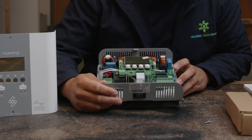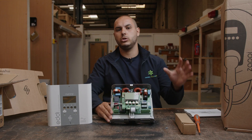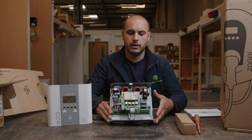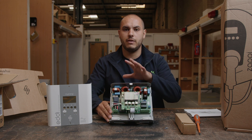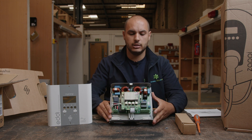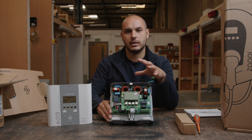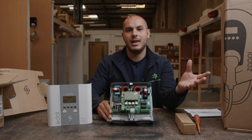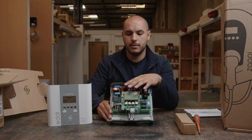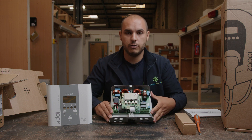You've got the supply, you've got CT connections there, and you also have the heater connections. Like I've mentioned, you can have this installed and basically wired up to a hot water cylinder with the heating elements in there. Any excess energy provided from renewable sources such as solar PV can be diverted with this device and utilised to heat up that water tank. This actual device can also be wired up in your central heating system — basically this can be the main source to take the energy from your renewables and be the main point to heat up that tank. Then you can have a relay installed as well, and that could be the changeover from utilising this as the main point to heat the tank and having the gas as a backup. But you would have to install the relay configuration for that to be able to happen.